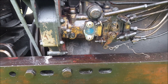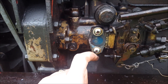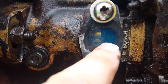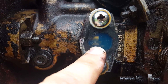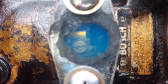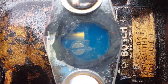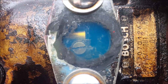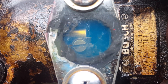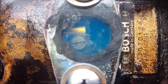Then you need to look at the mark in the pump. I have a clear plate on here for right now, but normally it's a solid plate that seals it. That flat piece is the indicator, held on with a little flat head screw. You will see a line on that black wheel back there — this is not the line. This is the line with an L next to it, which would be used if your engine has left-hand rotation. This one does not, so you should see a plain line, a silver line across that black wheel close to the indicator if your timing is correct.